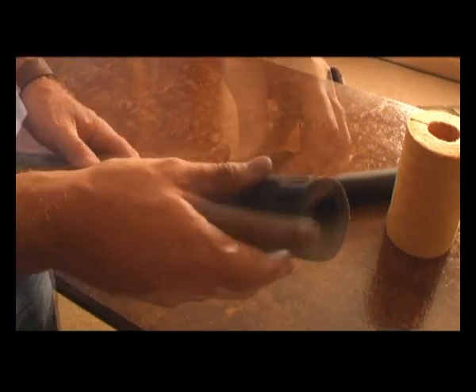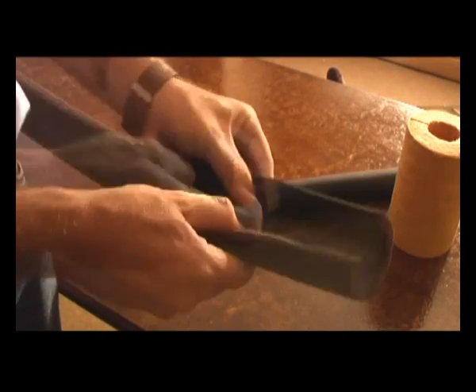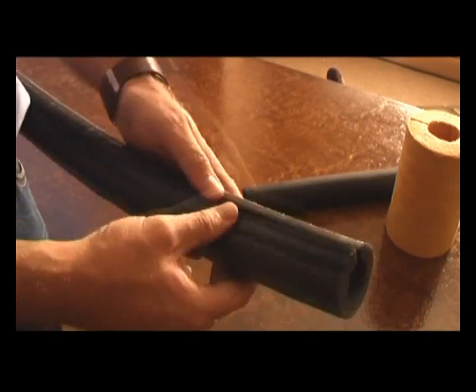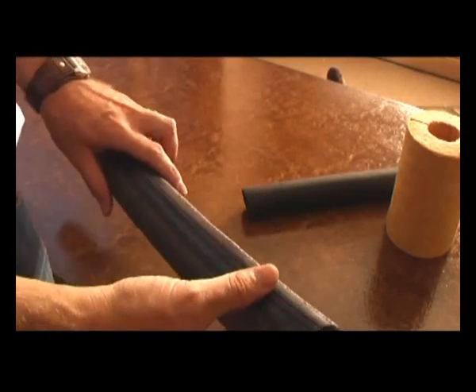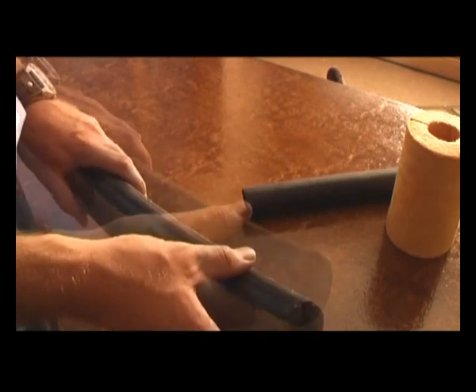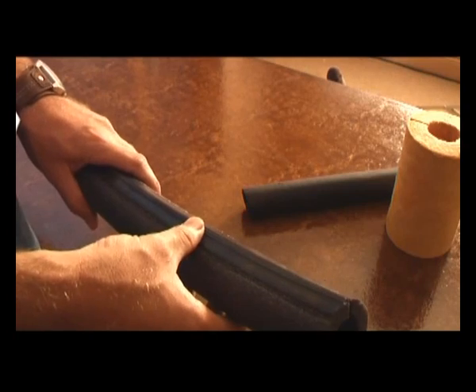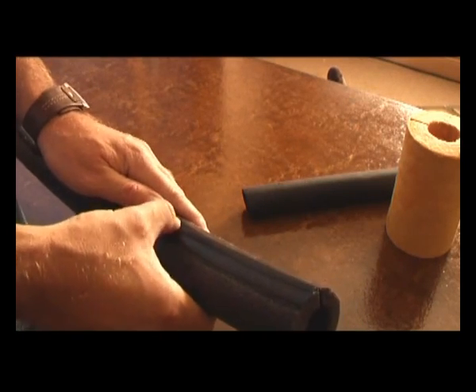This is another common type of insulation. It has a zip lock, so it can be installed after all the pipes have been installed and can be clipped onto the pipes. This is also not UV stable and needs to be painted if it's exposed to the sun. Remember that all pipes to and from the collector should be insulated, as well as the pipes going from the geyser to the hot water taps.